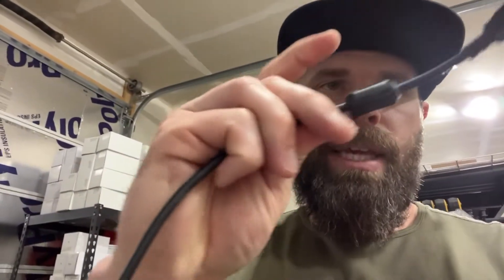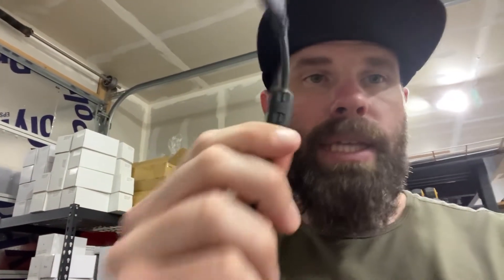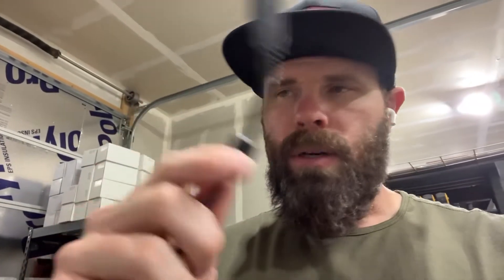One thing I didn't mention: I did get a USB cable and I made sure to buy some ferrite — I can't even remember what they're called — but basically they help reduce the interference of the cable. I often see people having communication errors and all kinds of stuff, and this could potentially be the problem if you don't have any of these ferrite deals. They help with electrical interference. I got a bunch in a little pack. Everything will be down in the description so you can get it too.